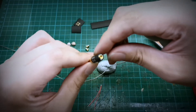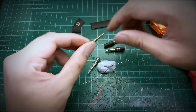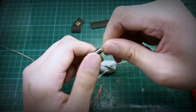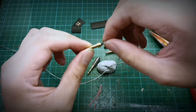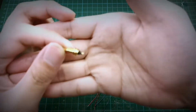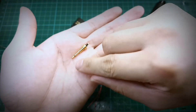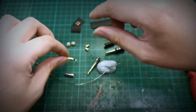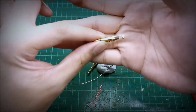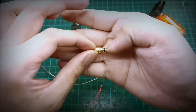This is MMCX to 3.5mm. In this case we are going to make a 2.5mm, but it is the same method with just some different steps. If you look at the interior of the 2.5mm, we don't have any clamp — this has a plus and a 2-contact pin. The 3.5mm version will look like this — we have the clamp there and 3 contacts.